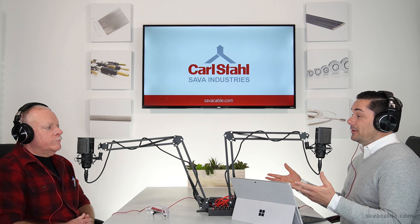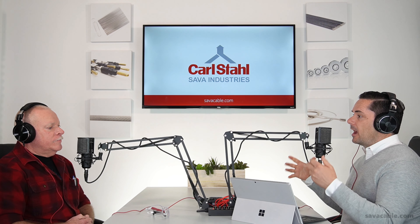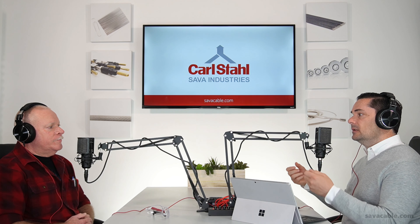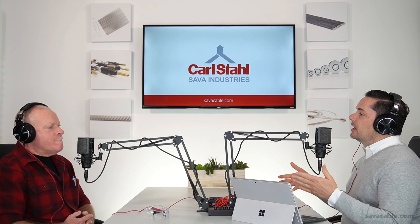So this is a conversation strictly about how cable is made — how different materials might behave in machines and in your hands while you're producing and manufacturing cable. Let's dive right in to the cable-making process. Tell me how cable is made — just fundamentally what cable is comprised of. We actually take individual wire, single wire, and we build it into certain constructions. It gets wrapped a certain way. A basic construction would be like a simple one-by-seven strand.